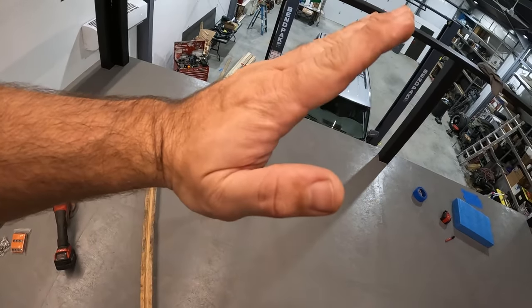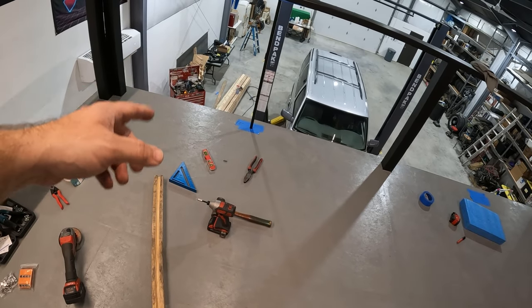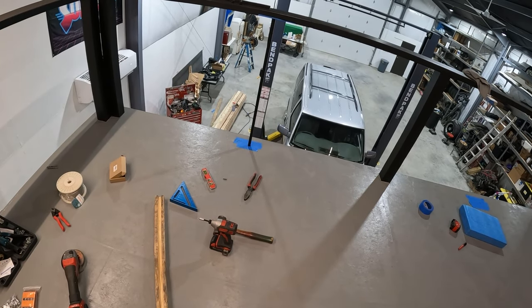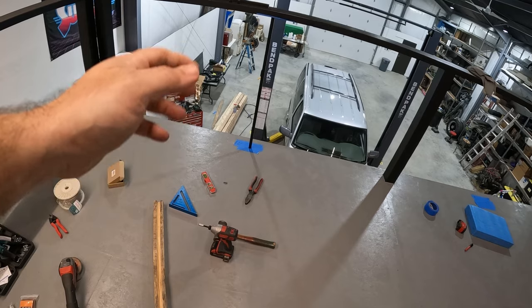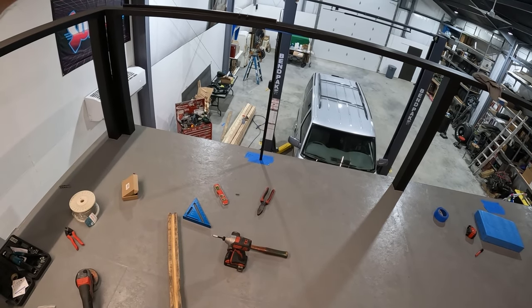I put it in on an angle because it's about 3 inches longer than the metal post, and I just hammered it in and wedged the rail up and finished knocking the bottom down in, and then lined the top up and slowly knocked the board back out with the metal post lined up, and then set the board on top of the handrail and hammered it down to lock it in.